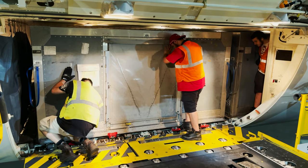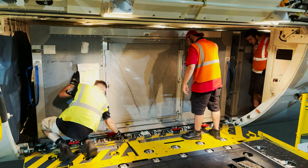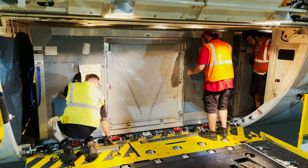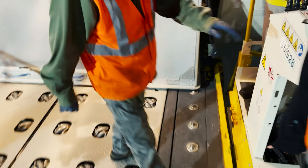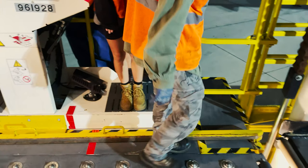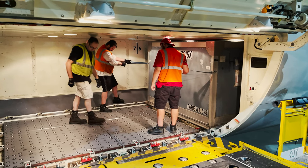P-sections are known for their tight space. When unloading the first ULD, be sure to send only 2 to 3 people up. Overcrowding in a P-section will lead to a lack of available space and inevitably an injury. Once the first ULD has been removed, remain in the safety zone on the K-loader until there is sufficient egress to enter the compartment. P-section ULDs are typically heavy.